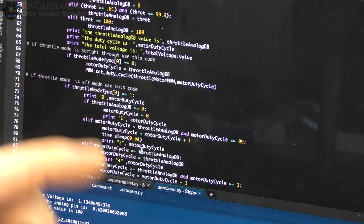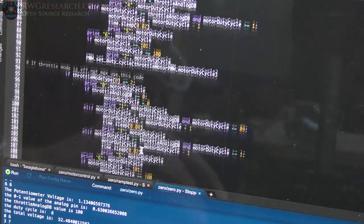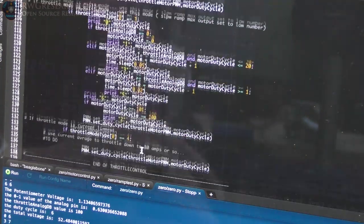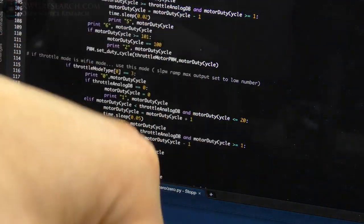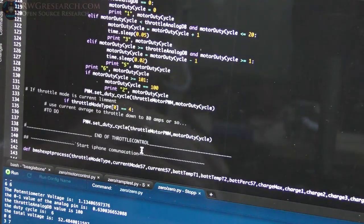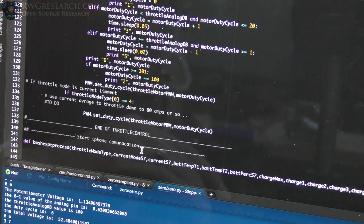I could disable the outputs because I will have relays turning on and off the motor controller itself. So I could write a value out of 0 for PWM and turn it off, or just turn it off, or whatever. But I've got to put a watchdog timer in there, because if I'm throttling this sucker and it sticks open because the program crashes because I didn't find a bug that happened only once, yeah, that could be bad. So I will have to add a watchdog for this.